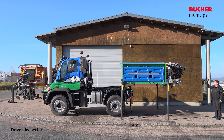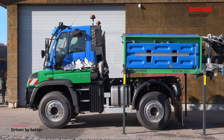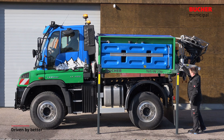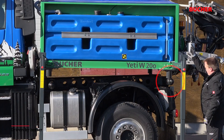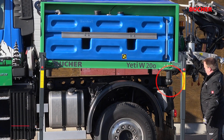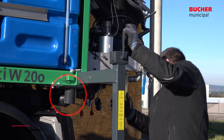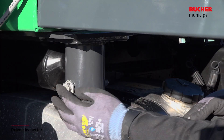to ensure that the spreader performs properly. Following successful inspection, the vehicle is moved back under the spreader until the ballpoint retainers of the spreader are above the ballpoints of the vehicle. The spreader is now placed on the ballpoints by means of the parking legs and secured with four steel screws.